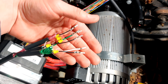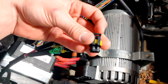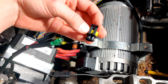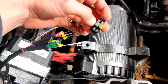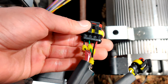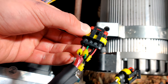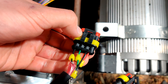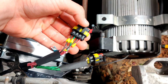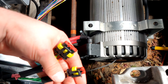Once you're done putting the pin ends on the wires, you can slide on the connectors. This is the two-pin connector for the thermistor — the left pin is number two, which corresponds with the white wire, and pin number one on the right is for the black wire, the analog ground. For the four-pin connector: pin four is the black wire from the red foil, pin three is the green wire from the blue foil, pin two is the black wire from the blue foil, and pin one is the red wire from the red foil. Once all pins are fully in place, push in the red retaining clip until it clicks, which locks it in place.